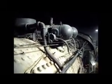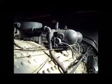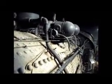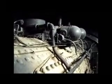Anyway, I mentioned the blowdown muffler up here. These things here are a couple of dynamos, basically two small generators. The steam flows into them and turns around a magnet that creates electricity for the cab lights and electrical appliances, including the headlight, and the exhaust flows out on those exhaust tubes there. So that's another thing that runs off the turret, and that's what you hear, the little whining noise when it's going down the track slow enough that you can hear it over the chugging, or when it stops.